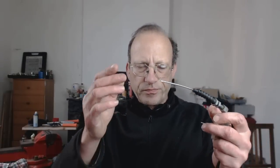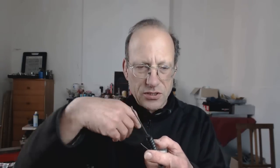Okay, so I've degreased with petrol, and got a fine wire brush in, and cleaned down the wires of the Bowden cable, splayed them out a bit to get any crud out of it, and then final degrease in acetone. It's possible that you could etch the surface with some acid, but I've just done it with the petrol, a wire brush, and the acetone.